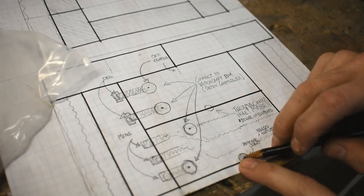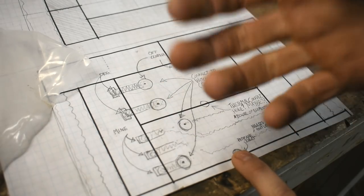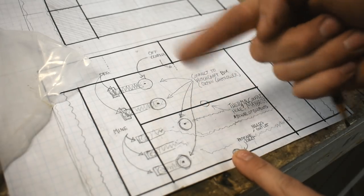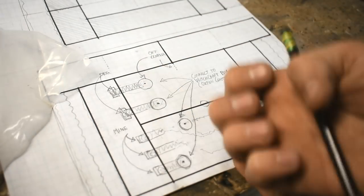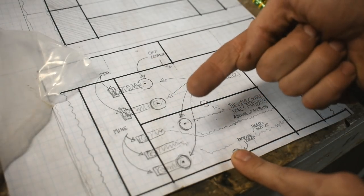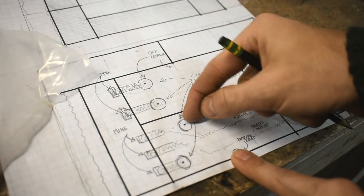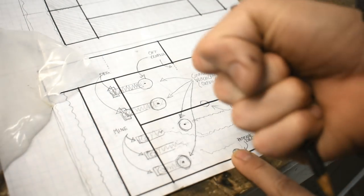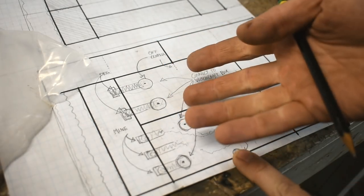That's how I'm going to adjust the atmosphere. So in a normal electric furnace like this, or an electric kiln, the one you just saw, it's called an oxidation kiln because all the oxygen's still in there. A gas kiln, or my gas foundry furnace, I tend to run a little bit rich, which would mean reduction. There's a lot of fuel, it uses up all the oxygen, and there's a little bit of extra fuel left. Now, if I'm melting, say, copper, having no oxygen is good because then it can't oxidize the copper. If you're doing something like pottery, the reduction atmosphere will actually pull oxygen atoms out of the glaze and the clay, and it'll change. It'll look different. I don't know if that affects heat treating at all.